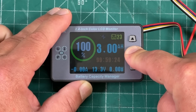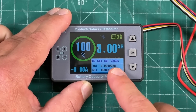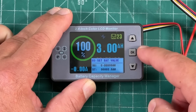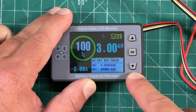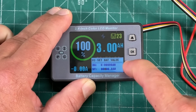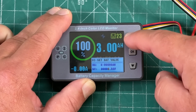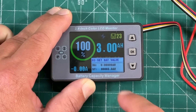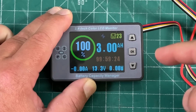Long press OK again to get back into the menu, hit the up button, and we're going to set the battery value — the battery capacity. In this example we're just going to say we're using a 3 amp hour battery. Hit OK — the digits turn blue. Hit the down arrow to cycle the red cursor between the zeros. This is a 3 amp hour battery, so hit the up arrow: one, two, three. Hit OK and now we're back to 'set battery value' highlighted in blue. Long press OK to save, or continue on to further settings.